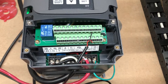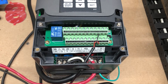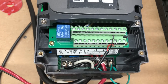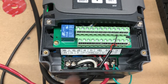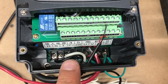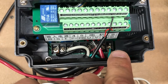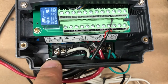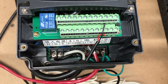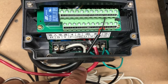When you get your spindle, it'll come with a cable but that doesn't have any plug on it. What you need to do is go to Home Depot or Lowe's and pick up a power cord — that's the first step. You need a power cord and it'll have three wires: a ground, a black, and a white. You'll wire the ground to the far right side, the black wire to R, and the white wire to T.